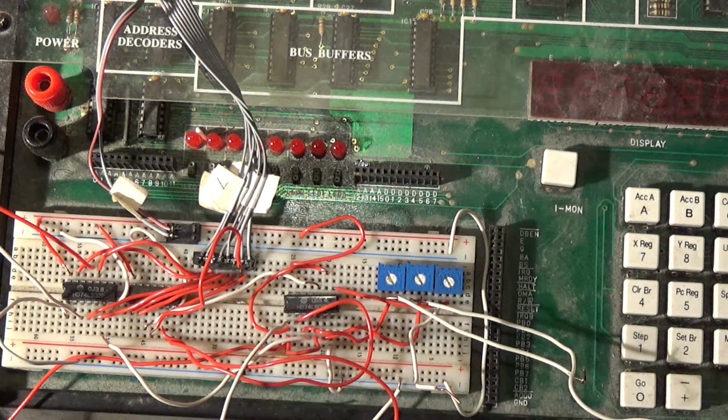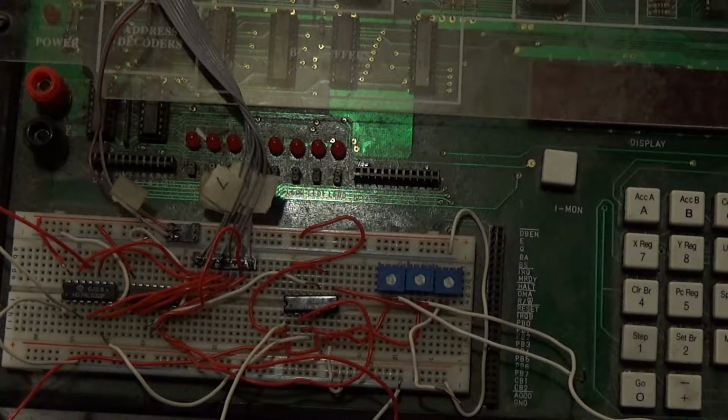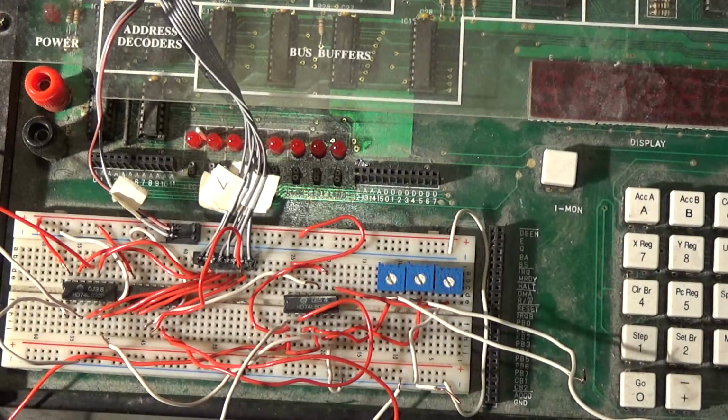And so what I'm going to do is, now this design right here does not allow for color intensity. So you have 8 solid colors and 0 levels of intensity. When I say intensity, I'm talking about how bright the vector beam is. I believe the original VECTREX has 32 levels of color intensity, and I want to keep that. I'm going to do this in a haphazard way, but it should work.